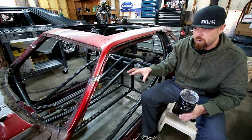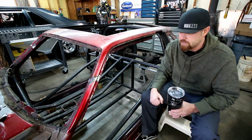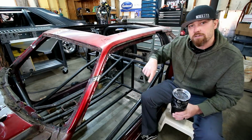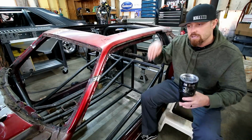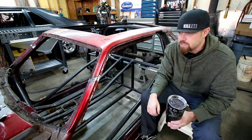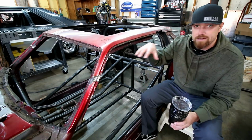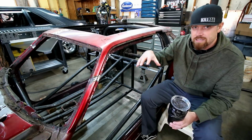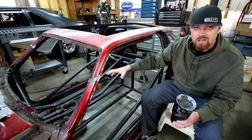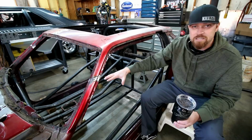And we'll probably add some bars up front to kind of stiffen the front section. What's next is that I'll have bars that come off that main trans hoop that will go down and be the actual engine mounts themselves. So the engine will mount to these tubes, the tubes will be mounted to this cross member, and then that'll kind of transfer through to these tubes. So it'll be like one long continuous chassis component.